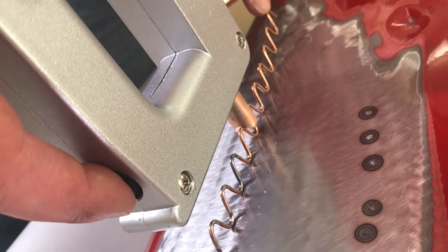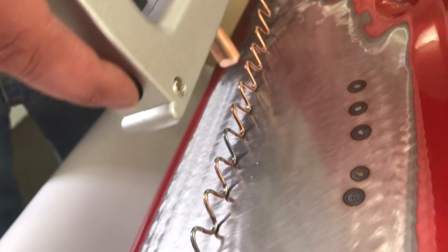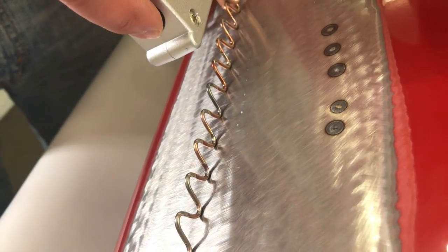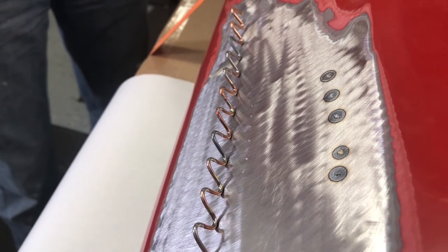The wiggle wire is just tacked on, so when you're pulling with the bear claw you don't want to use a hard jerking motion with a sliding hammer. You want to use a slow-pull method — a nylon ratchet strap works best.